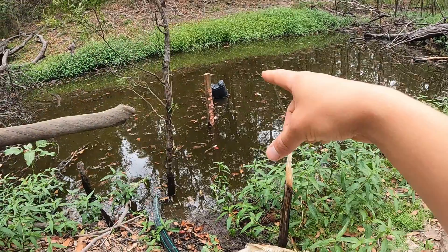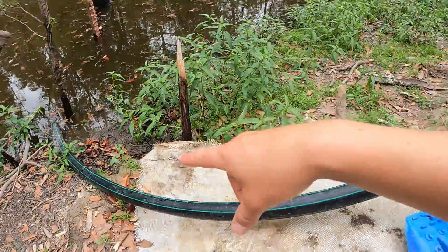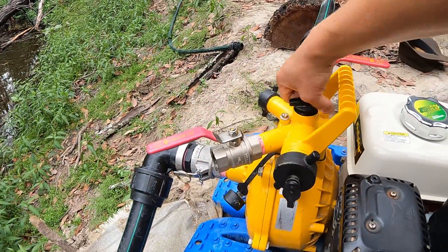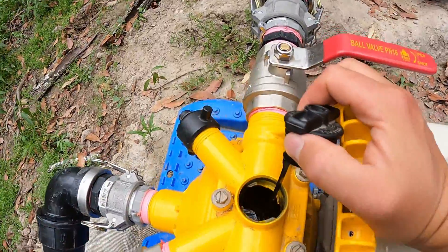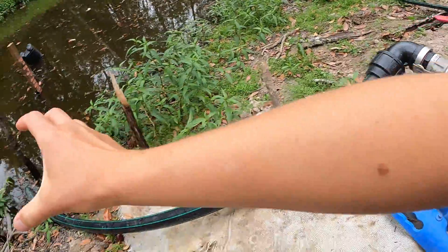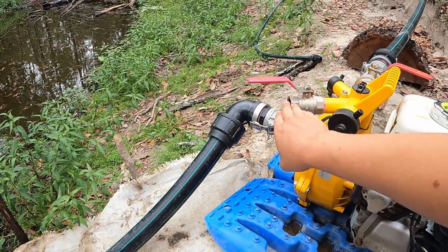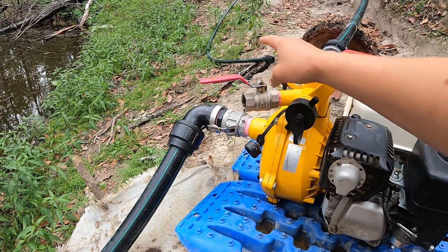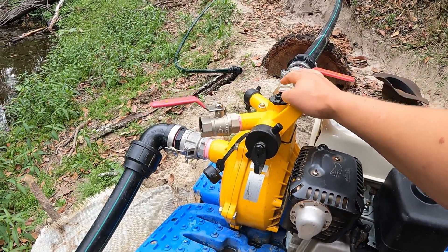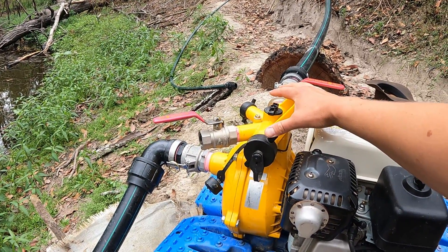But ours is all the way over there, so I basically just had the open end of this filled with water and then connected it to the pump. The next thing you need to do is open this cap here and that needs to be filled with water. Because to prime the pump, it needs to pull the water from all the way down there, through the system and have it come out. All of these ball valves and things like that we'll cover in more detail later.